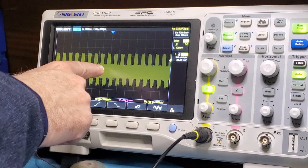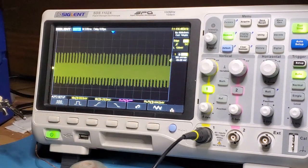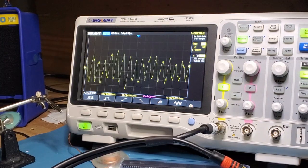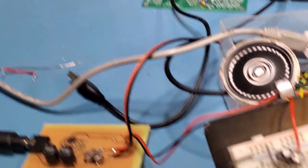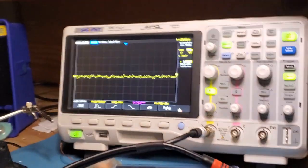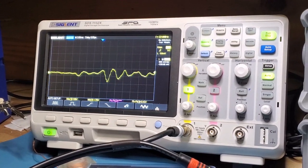There's that square wave — this is the actual frequency in there, and the carrier frequency is around about 400 kHz. Let's also look at this going through the microphone amplifier I built a while ago, which has some audio low-pass filtering on it, and see what those waveforms look like.